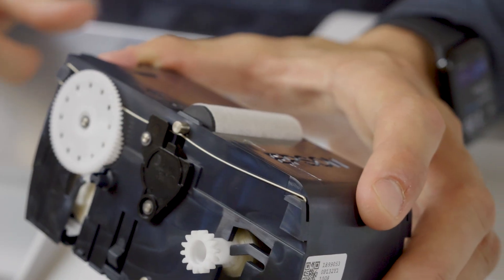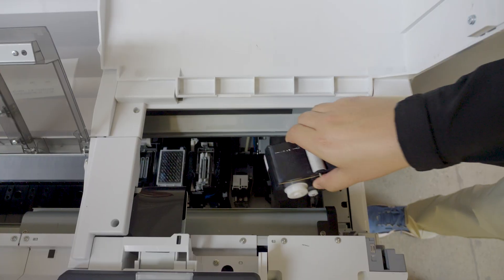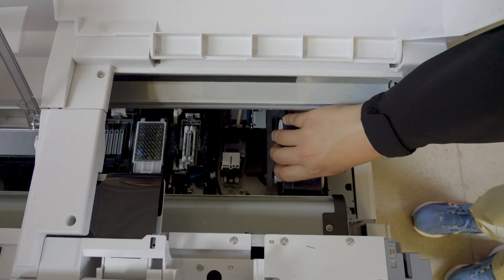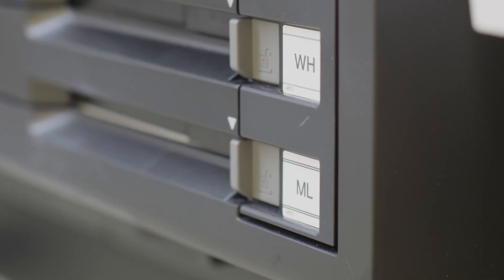One of the first things I noticed is the all-in-one cleaning solution — on other printers it's very analog, you're manually cleaning every day. Can you talk about how the fabric wiper works? The fabric wiper is like a lint-free cloth that wipes the bottom of the print head each and every time it does a cleaning. Furthermore, we have a maintenance liquid pack — you can see it right there below our white ink pack — which helps clean out our suction cap and clear the nozzles. All of this is done automatically, so there's no user intervention required.